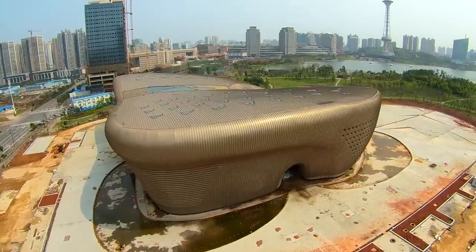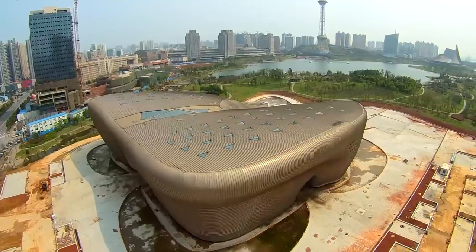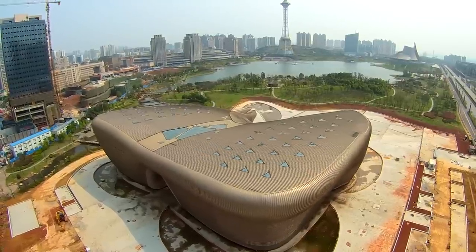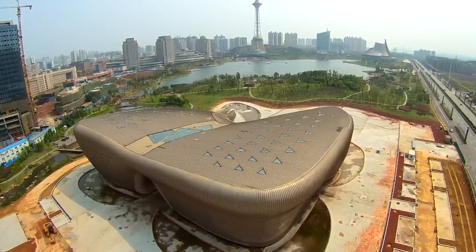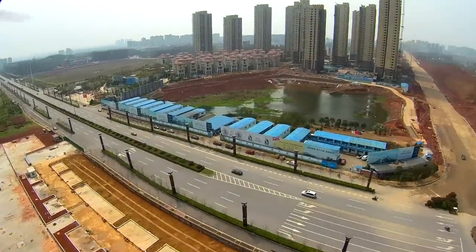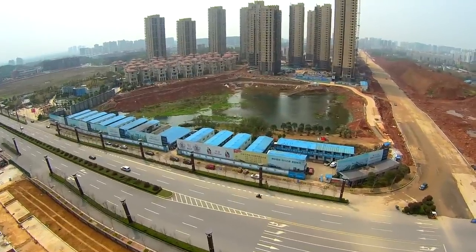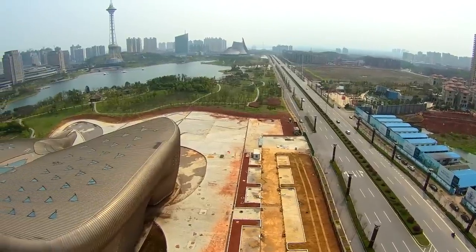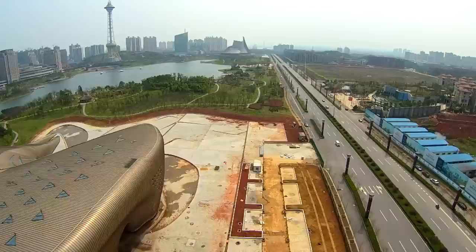Here's another shot. After a beautiful pan shot, I climb up and I wanted to take a full shot of this area by turning right, that means yaw right. And here the quad stops. I force it to yaw right, and I see the propeller, and again it goes crazy, turns to this side, starts flying to this side only, and then it turns back erratically and gets stable. That's where I activated the RTH.